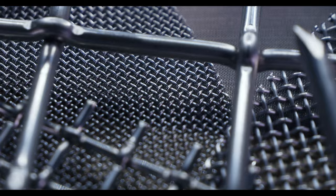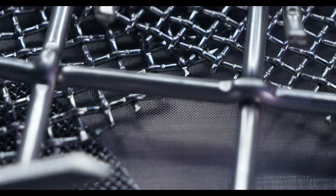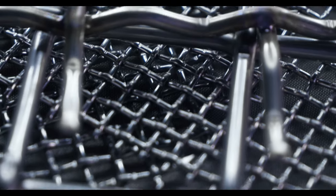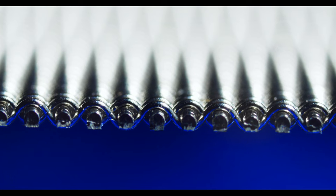The most beneficial aspect of wire mesh filters is that they're available in a wide range of mesh specifications. With a mesh count range between four inches to one micron, mesh filters deliver a high level of accuracy that people have come to expect from the filter medium. Also, the wires themselves can be woven to form different weave patterns, each with its own unique characteristics. This helps ensure the mesh filter properly removes contaminant particles while maintaining a desired flow rate.